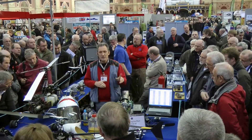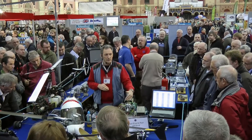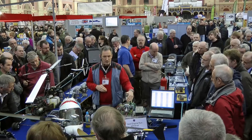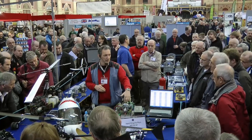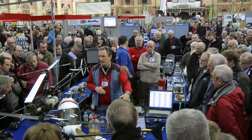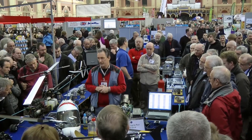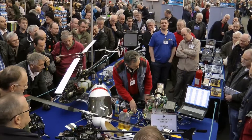Once we're through 400 degrees centigrade, the gas is switched off automatically, so we're then completely on the kerosene. The starter motor all this time is still continuing to accelerate the rotor. What we have to do on a jet engine is reach what's called the self-sustained speed — that's the point at which there's enough energy in the hot high-velocity gas passing through the turbine that it can drive the compressor with no external mechanical input, i.e. without the starter motor connected. That happens at about 22,000 RPM.